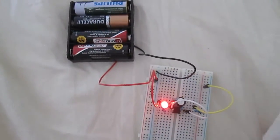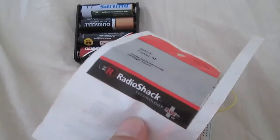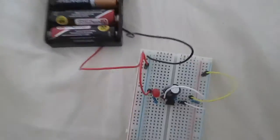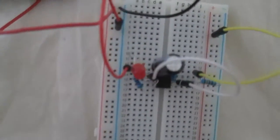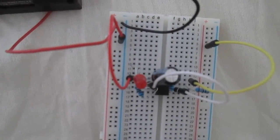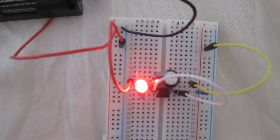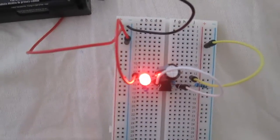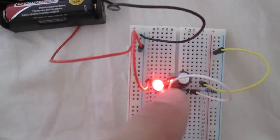I'm back — yesterday I picked up a 555 timer. Here's the circuit I built. It flashes an LED, and the larger the capacitor, the slower it would be, and the smaller the capacitor, the faster it would be.